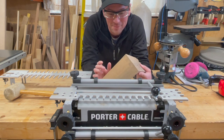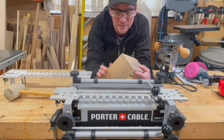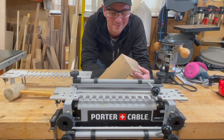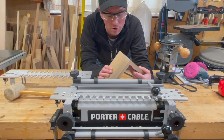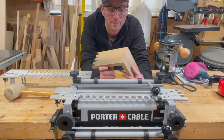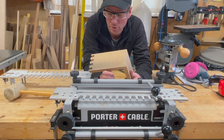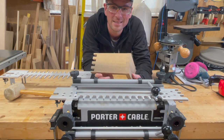Let's just do a final review. There's not too much to say — I'm very happy with how the jig performed. Very easy to go from the through dovetail template to the half blind template; really didn't have to make too many adjustments. Setting the router itself, just doing it once felt really nice. So if you're going to be repeating a bunch of these, it's going to be very quick to batch out some drawers or some boxes, kind of whatever you're looking to do. Very happy with the tightness of these, given that this is my first time using this template to do half blinds. Half blind is something that I really like and one of the primary reasons why I bought this jig, because I really did not like cutting them by hand. Very happy with the results — further confirmation that this was the right purchase for me, and hopefully this helps. Thank you for watching.